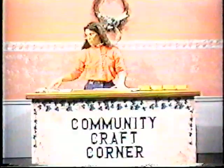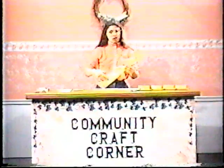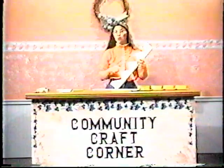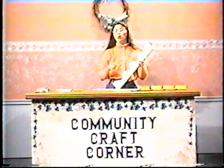What you do is you make it just like you would a stair stringer with these 7-11 marks, except for this stair, I use 3-4 measurements instead of the 7-11 when you're making stair stringers. And instead of bringing my big, bulky carpenter's square, I decided to cut down the 3-4 inch marks, and I put them on my square, and I highlighted them with whiteout, fairly easy, so that I could use 3 inches and 4 inches.